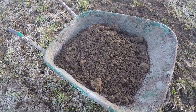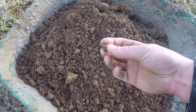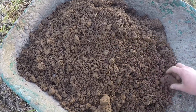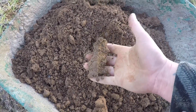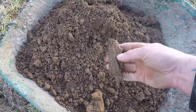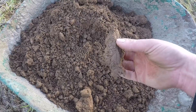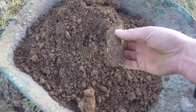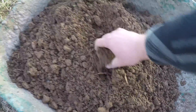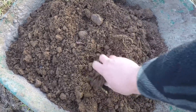Got a wheelbarrow full of subsoil. I can see straight away it's quite nice - there's quite a lot of stone in here, little stones, little bits of aggregate, which is nice, some bigger ones too. Definitely a lot of clay, probably a little bit too much clay. We need to find out if this is really expansive clay or not, because if it's going to expand and contract with moisture it's going to cause us problems. The stone is going to help a lot.